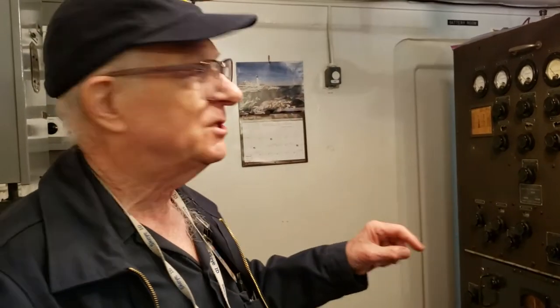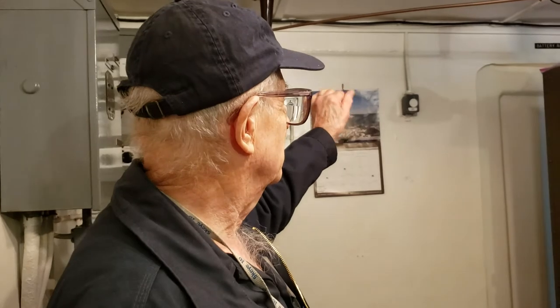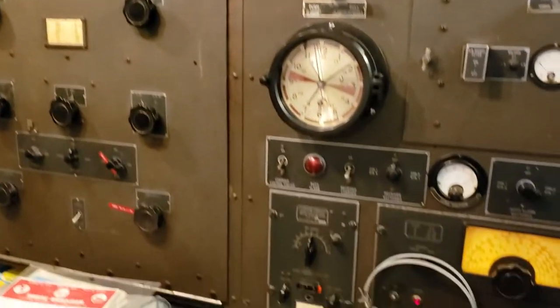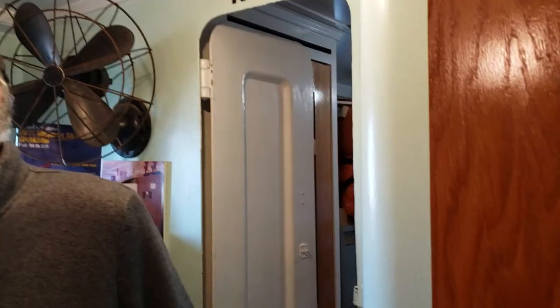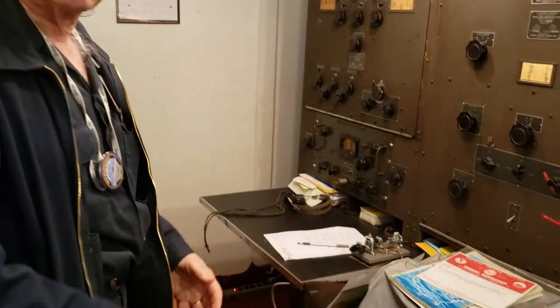And again, the ship is basically DC. So you'll see a power outlet like that. And it has that childproof thing on it, which is not necessarily for children. It's like, don't plug anything in that DC would blow up. I've used it for soldering irons, straight irons, and trouble lights, but it's DC. Most of the staterooms do not have any AC in them. They've been adding AC here and there. When the ship was refurbished in 66, it got an extra shortwave receiver, the radio telephone, and an AC outlet, which gives a little more. So there's an AC outlet, but that's from 66. But like the operator's stateroom, there's no AC in there. For the lights, there are outlets, you can plug a shaver into the outlet above the basin, but it's a DC outlet. That was the style back in the day.